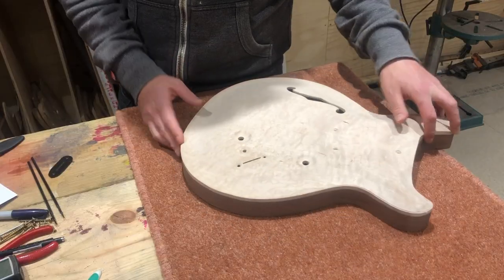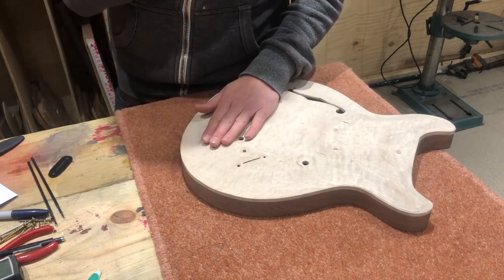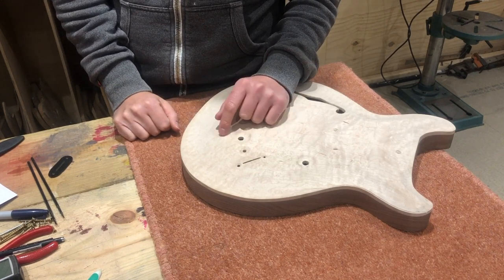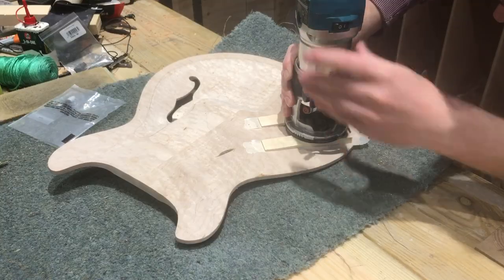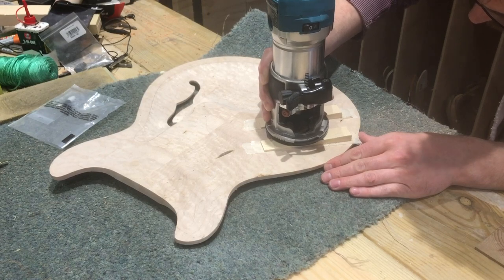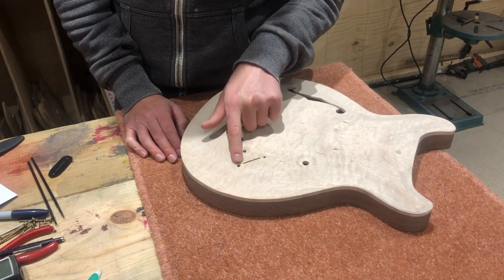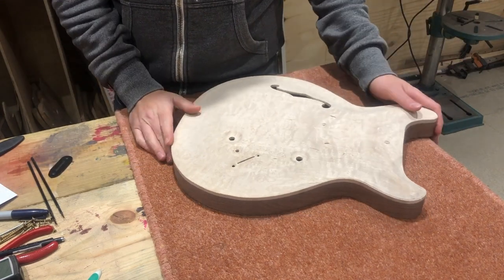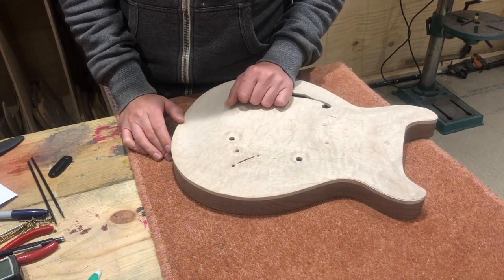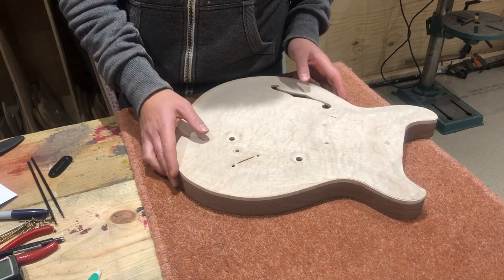What makes this more complex is the carve — this blade switch needs to sit at an angle to fit this shape. I made a couple of shims at an arbitrary angle, maybe three or four degrees, so the shims are thinner on one side than the other. Then I used a trim router along those shims to route away the underside, meaning the blade switch slot sits slightly higher on one side, slightly lower on the other. I did get a little close for comfort and just realized in time — another reason why you should always plan your guitars out. Had I drawn a profile on paper, mapped out the carve with carving templates, I would have known the right angle. But hey ho.